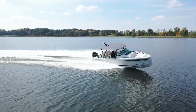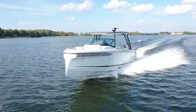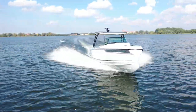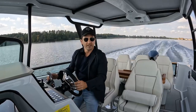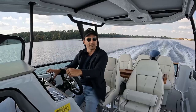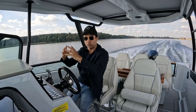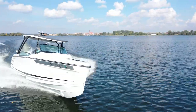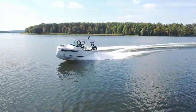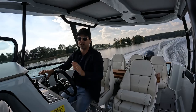Let's wind it back to normal speeds and give you a demonstration of what's actually going on. This boat's about two and a half tonne empty, probably about three tonne fully loaded. The standard is 225 horsepower and I'm running a 300. I'm now winding the boat back to her fast cruise speed of 27 knots. Can you notice the audio difference from the motor right now? It doesn't even feel like it's woken up because it hardly has. This boat has got so much capability, so much power. We've got a very deep V cutting entry, double air step hull and a deep V profile underneath the waterline. She's going to be great offshore.